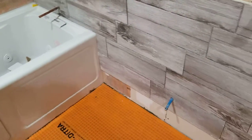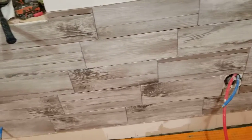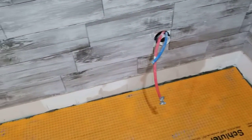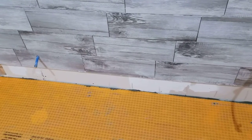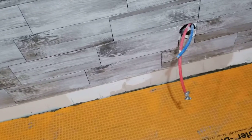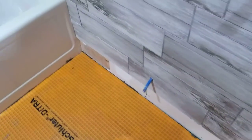We'll step back a little bit so you can see the tile that's on the wall. I'll put the last row down after I put the tile in on the floor, so it will be right up flush against that and I won't have to worry about any gaps between the wall and the floor — that row of tile will cover any mistakes I make in cutting or measuring. The wall tile will be a lot easier to cut and fit down over the top of the floor tile.